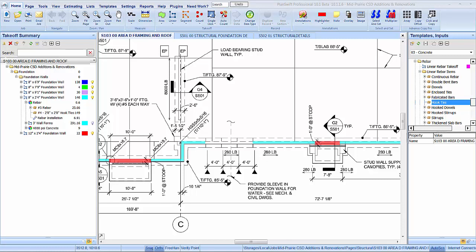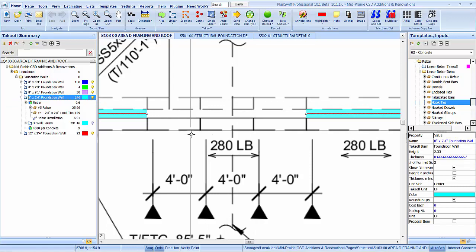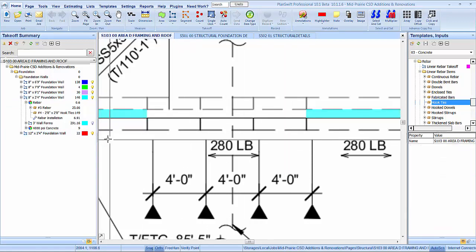It's going to make that 5'2". We're already at 2'4". Let's call it 5'4", give us a couple extra inches. This here would be a 5'2" wall to get that pipe in at the elevation that they need it in. Coming in, I'm going to drop it an extra 2 inches just to give us a little more room to work with. Plus, it makes an even 3-foot jump, so that'll even out the jumps there for us.